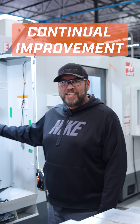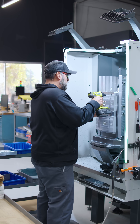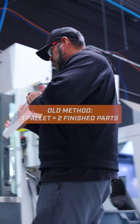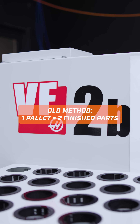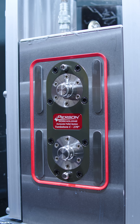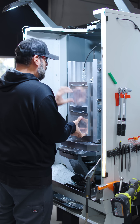Right now I'm running our 610 pallets on our EC400. We're able to mix and match for any pallet size, and for this run we're opting to mix in four at a time with other sizes. We're using the same system — basically our PPS pallet goes onto our HPS system, so you're literally able to use the same fixture for this system.